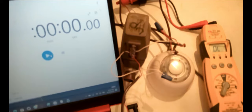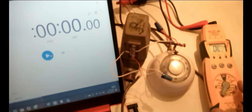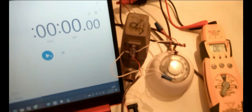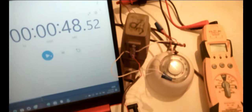What I'm going to show you now is why you need a little bit of patience when diagnosing these things. These coils can take at least a minute — sometimes even longer — to heat up enough to actually expand and push that valve down to activate the end switch. So I have my meter hooked up, set to continuity, with a timer ready to go. We're going to turn our thermostat up, call for heat — click — start our timer, and we'll see how long this takes. And there we have it: between the time the thermostat called for heat and the time our boiler fired up was about 45 seconds or so.